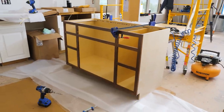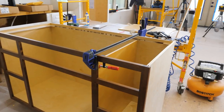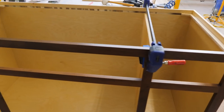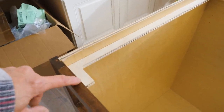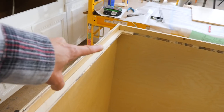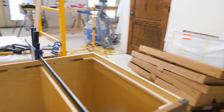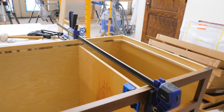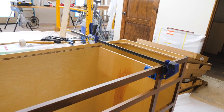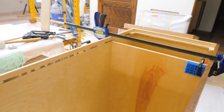I've been assembling this custom six-drawer two-door vanity base cabinet. These are a little different — you've got to do a bit of extra work. The sides are normal, and they've got side strips with splines in the front that go into the face frame. These are dovetailed, which is pretty normal. It took me a minute to figure out where those went, but the pilot holes for the drawer slides are already back there. The weird thing is the divider panel — because these are optional, they don't pre-rout any of the dados or splines for the face frame.